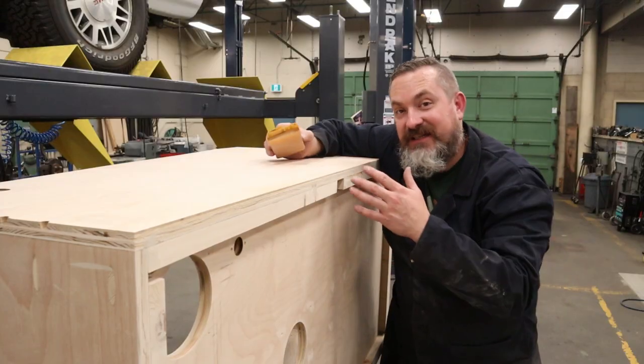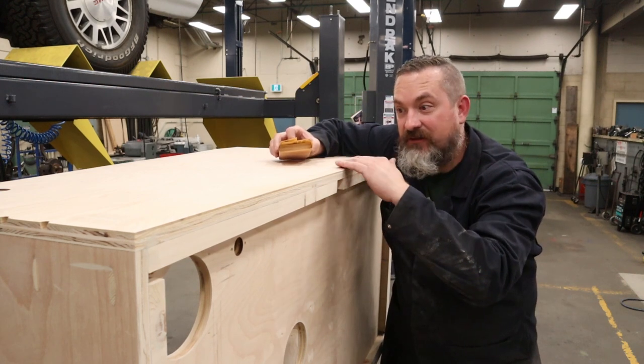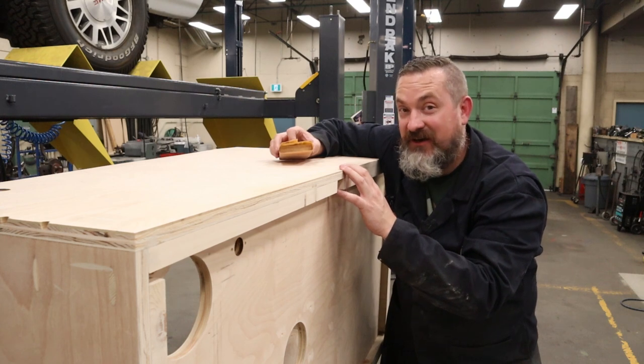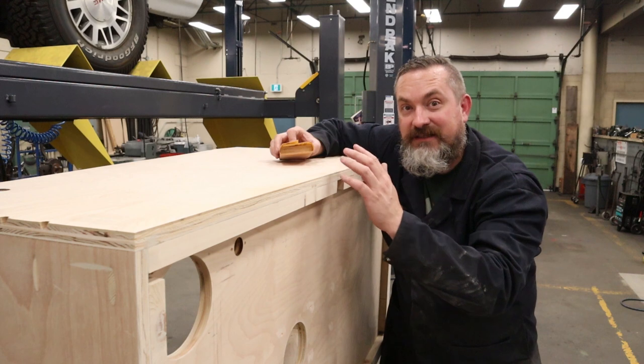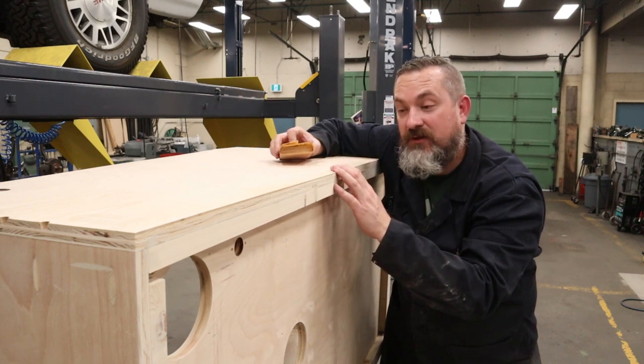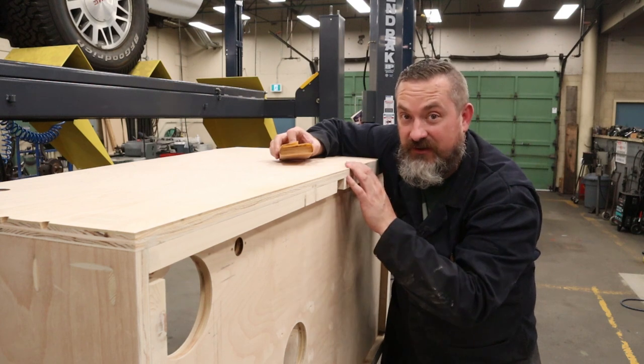Now I've got this cabinet on its side so we can talk about this bottom edge here. The top layer, the veneer layer of your plywood, is very susceptible to getting chipped off. It just takes some clothes rubbing against it, or when you lift this with a pinball dolly, you can catch the edge and tear out not only the wood, but the paint and your vinyl artwork.